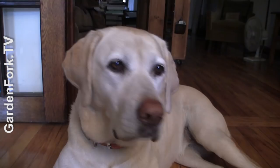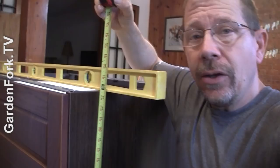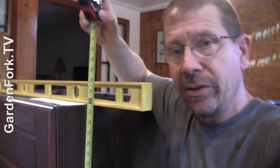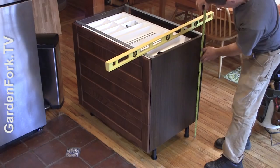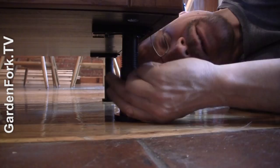Hey, real quick — if you want to see the video of me assembling the base kitchen cabinet, there's a link at the end of the show to watch that, or it'll be in the show notes below. So my standard height for the top of a cabinet is the height of your dishwasher, which is 35 inches — check with your dishwasher installation instructions on that one. So I adjust the cabinet to be 35 inches and level. Level's important. IKEA has these adjustable feet and they're pretty neat. They're kind of tricky to get on — you need two people to put this all together. But once these puppies are in, you can literally by hand move them up and down. There are four of them for the cabinet, so you make it 35 inches and level and you're good to go.